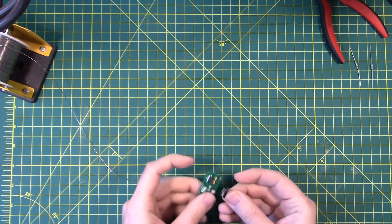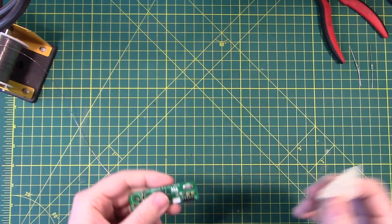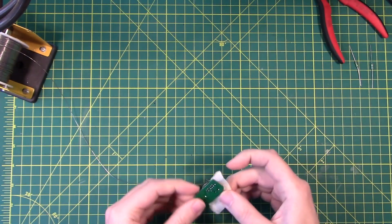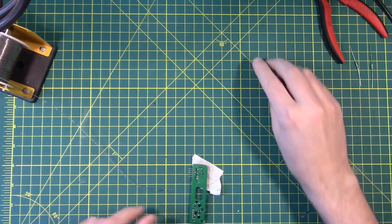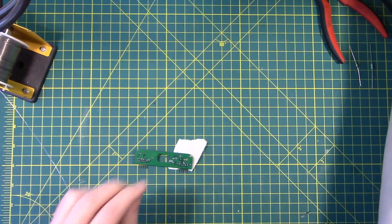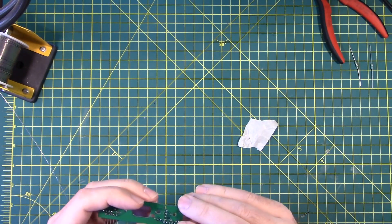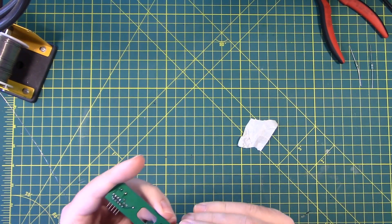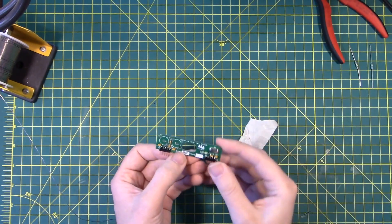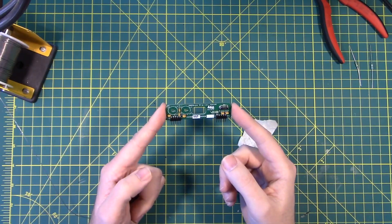Let's get the pins put in the board. It's kind of obvious how these things go — pointing down so the boards can interface with each other. I'm going to tape this down to make life a little easier. Capacitor C30 and this last pin are really close together — I did not connect them, but be careful when you do that. And that is it for putting together the daughter board. I have two more to do, and then we will get into winding up some toroids.